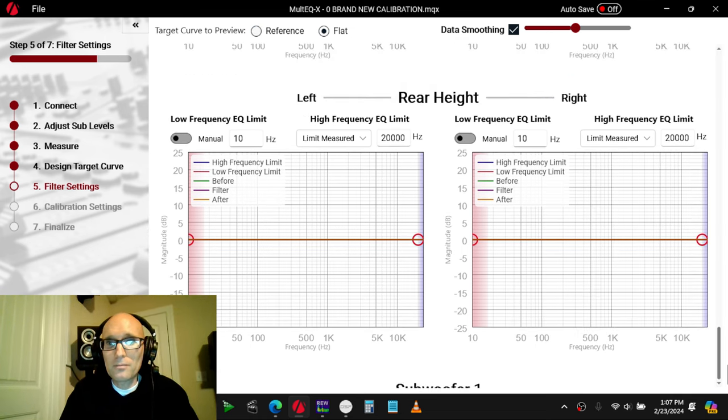So gains are 0, the master volume 0, and we are analog RCAs. So this is all set up. And again, the input 1 is going to output 1 and output 2. So it's just splitting. It's taking that signal from the receiver and just putting it into the same outputs from input 1. So I think we're ready to go. I think that's just a quick early explanation, I guess, of how everything needs to be set up before we even start. All right, volumes real quick.